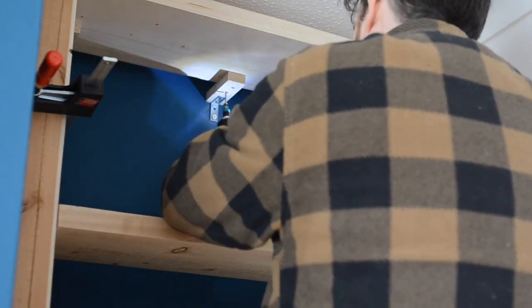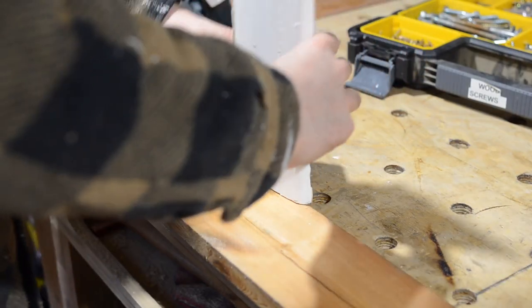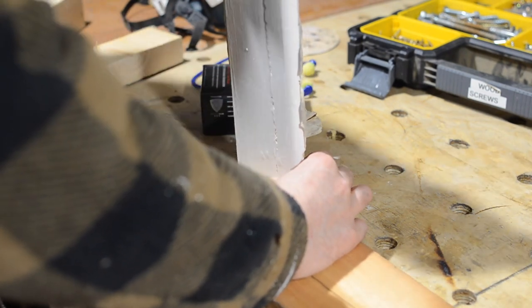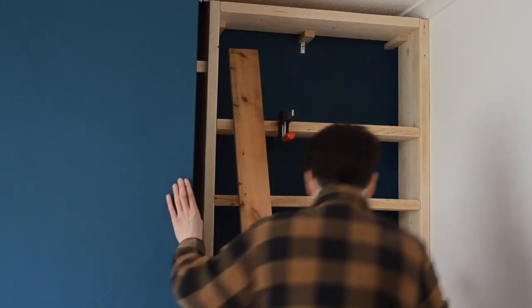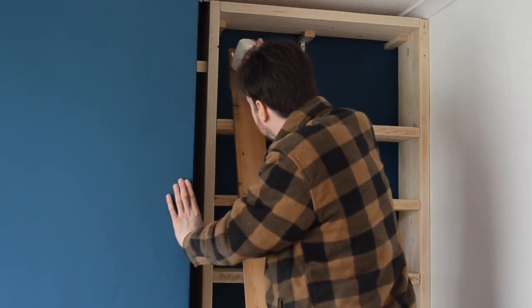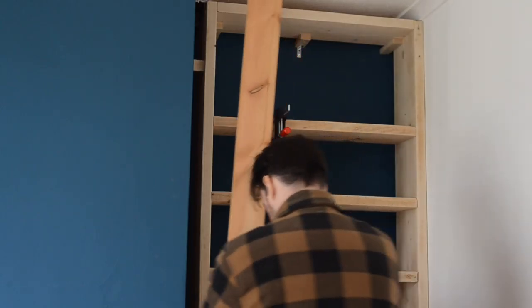By the time I've got some books in place you'll never see this bracket. The bookcase is now hiding all those pipes from the side, but you can still see them from the front, so I need a capping piece. I've got a bit of wood that would do this, but I need to cut out the shape of the skirting board from the bottom so it can slide into place. I draw around a scrap piece and then cut it out with a jigsaw. This bit of wood can then get glued onto the front of the bookcase — a bead of PVA down, get it put in place, and get some clamps tightened up all the way down it.